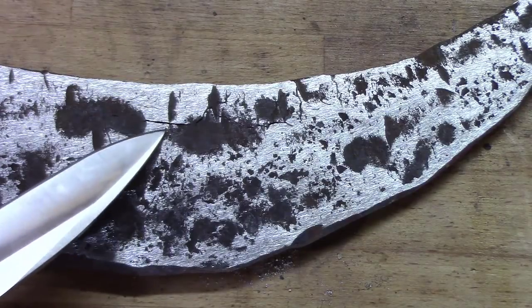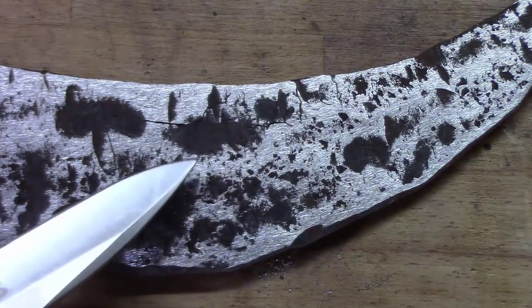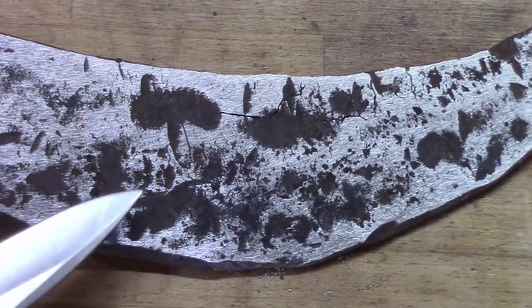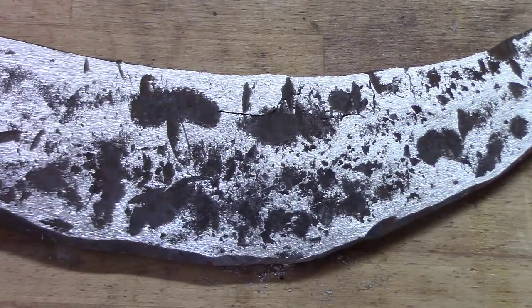As you can see, there's a crack right here, and there's a bunch up in here. I'm pretty sure there were some down here too, but you can't see them from all the rust. But yes, this is stuff you need to consider, because you may spend a long time on a project and have it do this to you. So always, always anneal it.